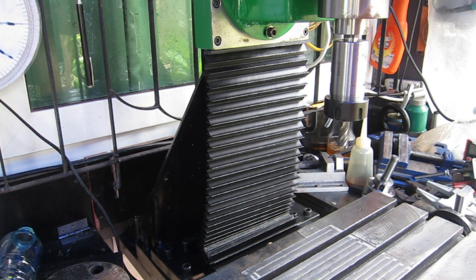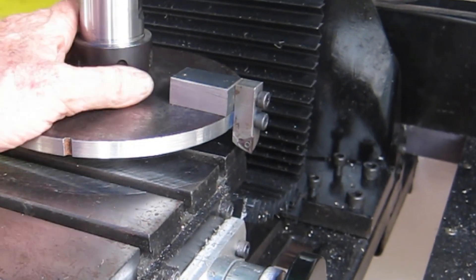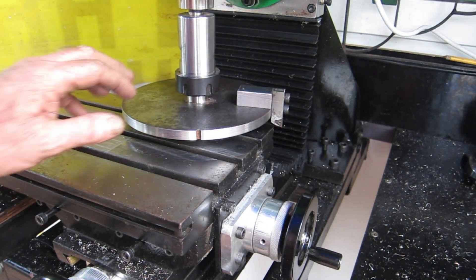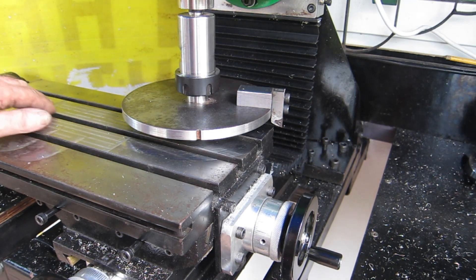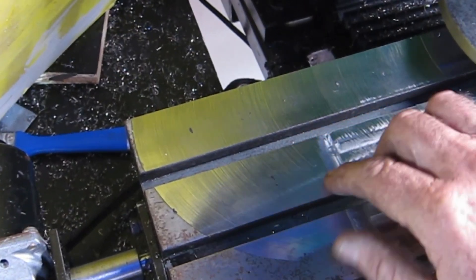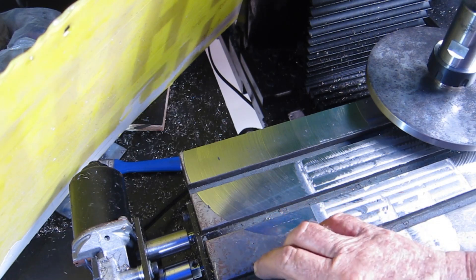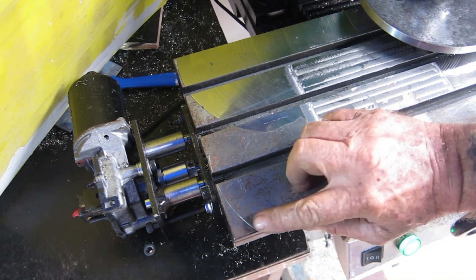Well viewers, it's finished. I made a couple of test passes and you can tell it was making noise because old mate's music is turned up full bore over the road. I made the tool up and bolted it all up, but it didn't achieve what I wanted for balance - it still wobbles a fair bit. I might have to try adding more weight. The finish isn't brilliant but it's working better than that other fly cutter. As I suspected, that's as far as I'm going to get up this end - it's a little worse on this side. You can see the line I scribed in it just to see how far I'd get.